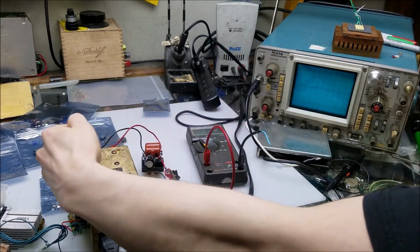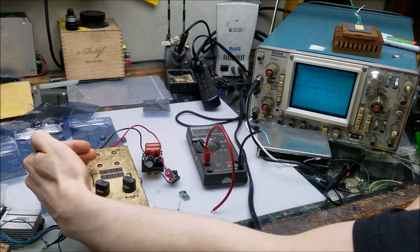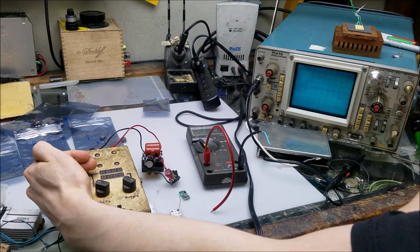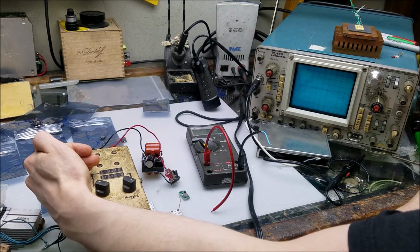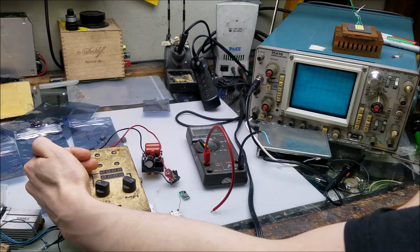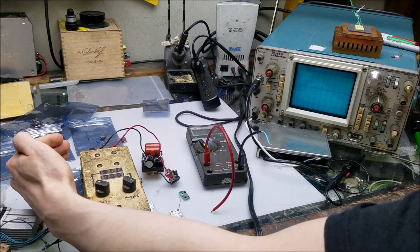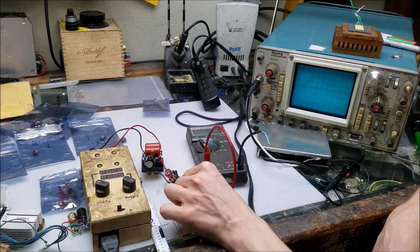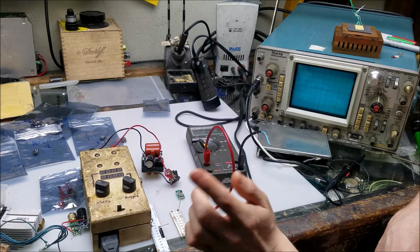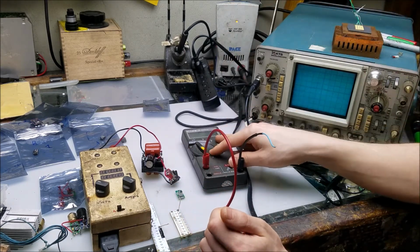So what I have here is my power supply, and I'll be using this to test the laser diode driver's ability to hold current from about 3.5 volts all the way up to 5 volts, paying attention to how it does from 4.2 volts, which is the fully charged chemistry of a lithium ion cell, up to 5 volts, to see if it maintains current well. A good laser driver should keep current constant, as these are supposed to be constant current drivers. But we'll see just how constant current they are in these tests. So let's go ahead and set that first test up.